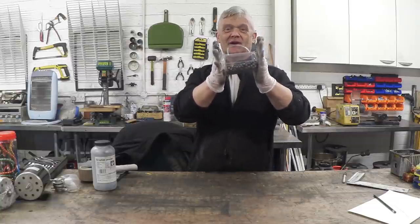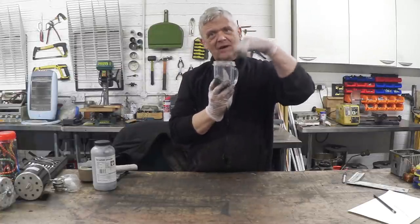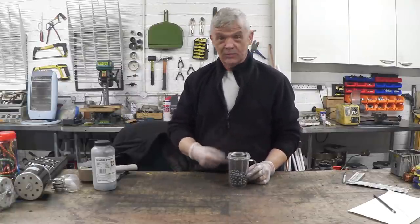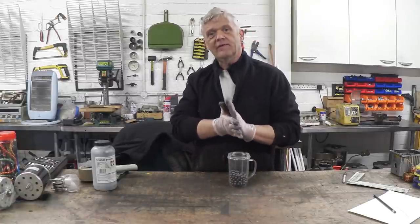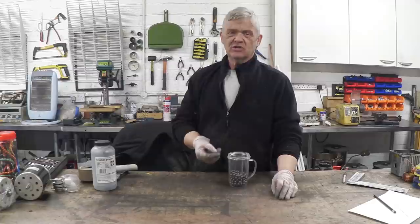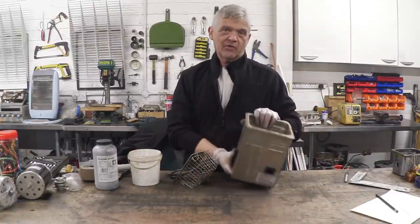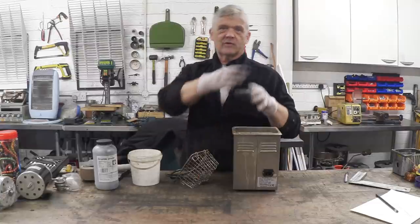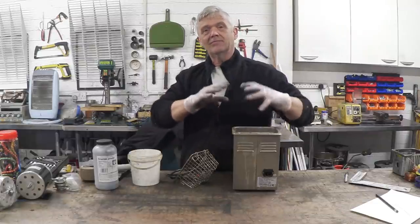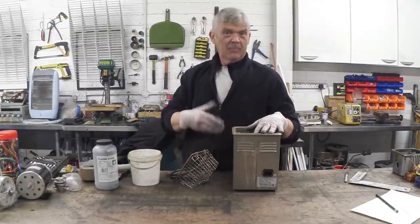So we changed from a rotating ball mill with drop-down impact to a stirrer arrangement. As the beads are stirred around there is no impact — it's all low shear. We put some graphite in there with glycerin as the glue and just turned it for ages, low-shearing the graphene until we got a mixture of graphene and glycerin. Glycerin is much easier to separate than solid glue. Another shear-based method is the sonicator — this is a bath sonicator, though you can also get horn sonicators. They create high-frequency vibration that jiggles everything and shears the graphene off, so sonication is yet another mechanical method based on impact and shear.